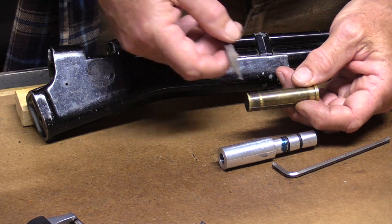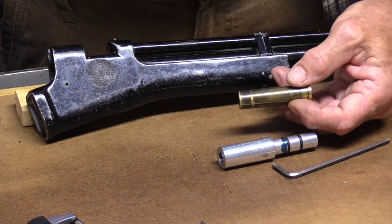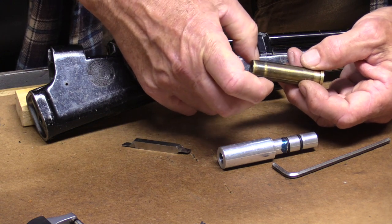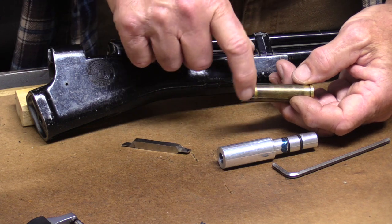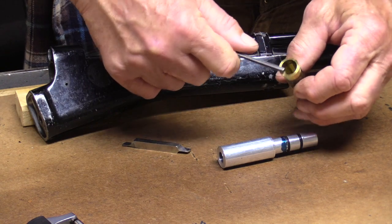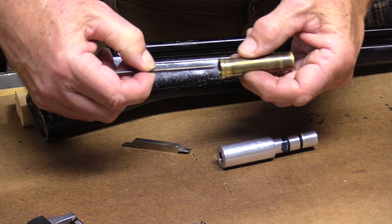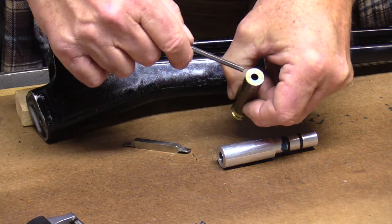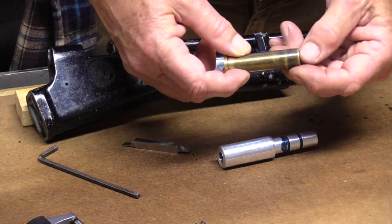The depth is specified on the drawing — somewhere around, when you're done, the inside of the groove should be around 450 thousandths if I remember right. We do it at this end because it's got more meat. This is thin at the other end, and when you go to this end we've got much more thickness — lots of metal to accommodate the O-ring.